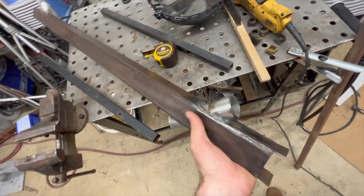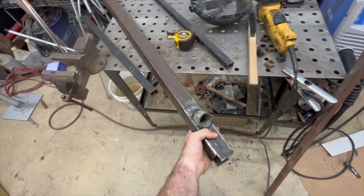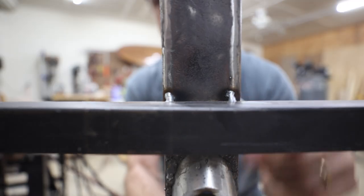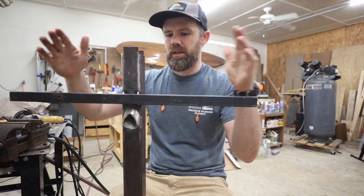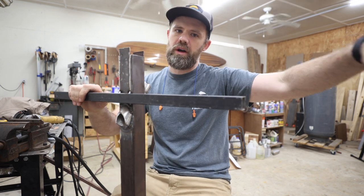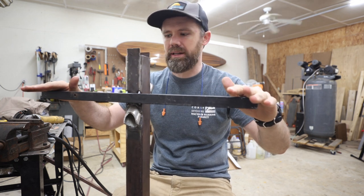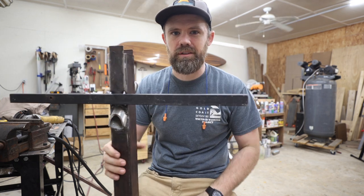The pipe is welded in — not my best welding work, but it'll do. Next I want to build a rack with a little platform, some area where we can stand up. I've just tacked on a one-inch square tubing piece that's two feet long as a test — I want this to work on the ground as well as on the roof rack, and on the ground it won't be bolted to anything so it might tip. Let's go test it out.